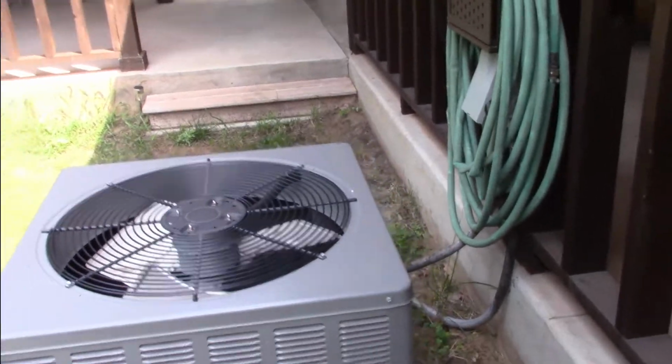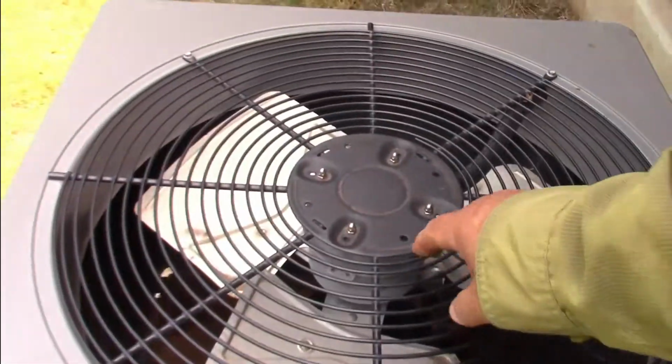So one rule of thumb you can check is, when your air conditioning isn't working well, I used to run outside at my other house, where I had 2 ACs in a big home, and put my hand over it. If it felt warm, because you're blowing warm air, you know that's not the problem, so it must just not be working as well, or it's that much hotter out. That's one quick way of knowing if your compressor and fan are working right. Another thing: if your AC starts to cool good and then fades off, your cooling fan could be bad. Okay? That's that right there.